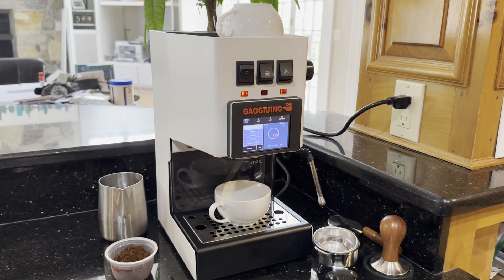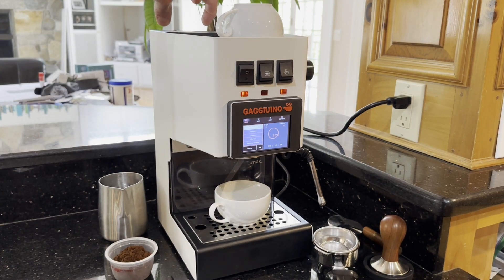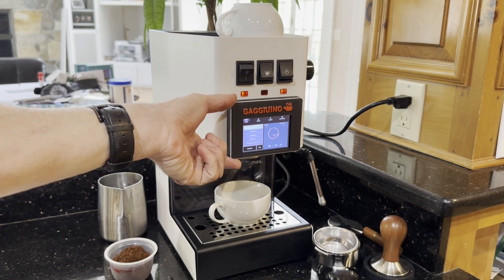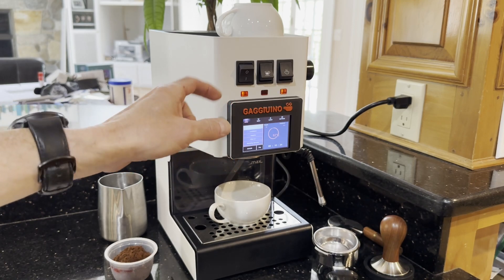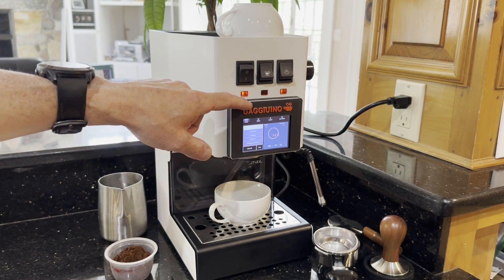I don't know exactly how long this took me to build, but it was a really long time — not only many hours of reading and learning, but probably at least 20 hours for the actual process. I saw someone say they did it in 12 hours, but I don't think I could have done it in 12 hours, or maybe I was custom changing parts along the way. For example, most people use a 2.4 inch display that sits on top, but I wanted a larger display and there's really no room up here. So I designed this to house a 3.5 inch display, and had to model it and 3D print it many times to get it to fit — and I did it in color, so I have three different colors.